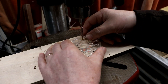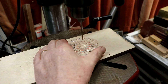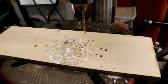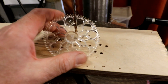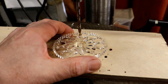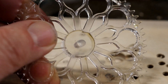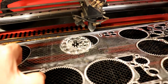You do have to hold it very firmly, otherwise the drill bit tends to snatch it up. Inevitably, number 3 snatched up as the drill went through, then spins round and you end up with a far from round hole - it's almost more like a slot. So that's useless. It's the next day - I had to stop doing this in absolute disgust at myself. So I've had to cut out another one, which is fine, not too bad.